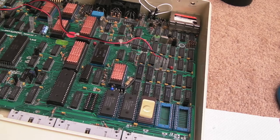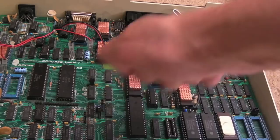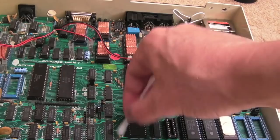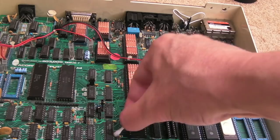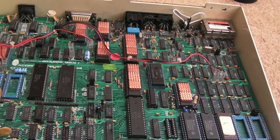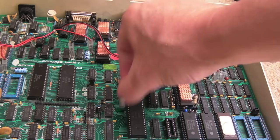The next thing is to clean the board — using cotton buds and IPA. On cleaning technique: I've seen people using IPA spray cans with a brush, but all that does is move the dirt around. You need something like cotton buds or kitchen roll to actually collect the dirt, or tilt the board and pour IPA over it while brushing simultaneously. IPA does not make dirt disintegrate and vanish — you've got to collect it, which is why I always use cotton buds. Ideally use an ultrasonic bath.